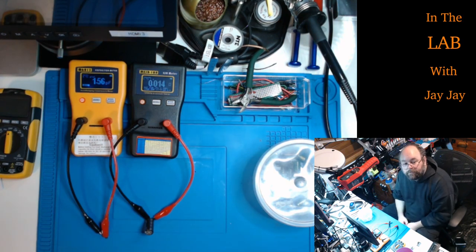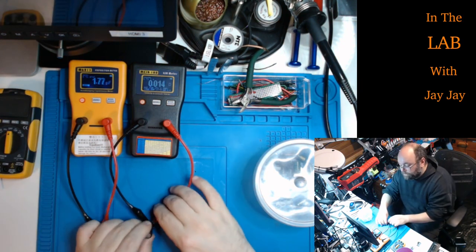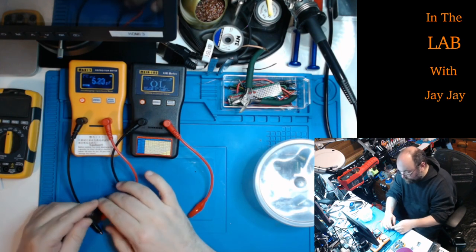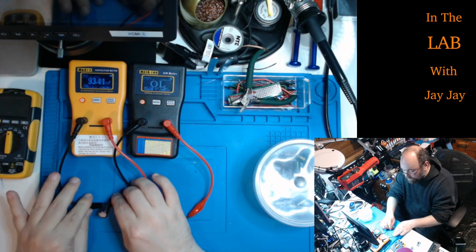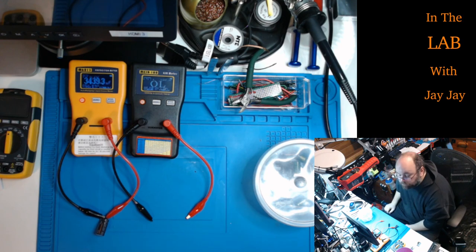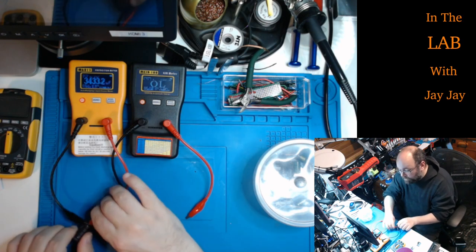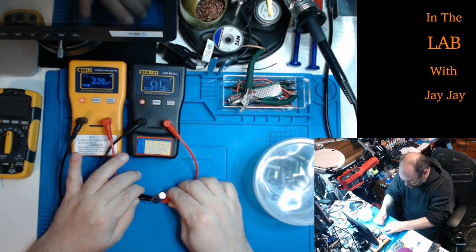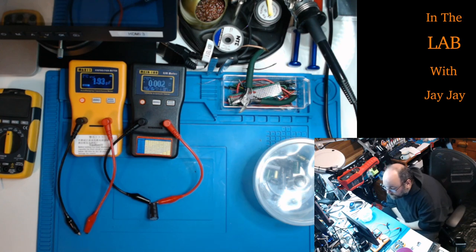Can you see that pretty well? I think you can. So let's just do it again for the record. So this is positive. And this is negative. And the rating goes up to 3,400, which is about right. And then this guy goes down very low, and then comes up and settles out. Oh no, as it warms up, its ESR is changing, but its ESR is still very low.